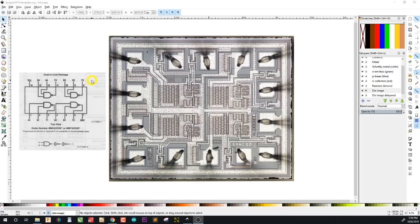Over here I have the pinout for reference. Usually the first thing I look for is pin 1, which usually has a different shape from other pins. We can see that this pin definitely has a different shape — that's probably pin 1. I also look for power pins, which are usually connected to large metal nets. Here's one example, and this pin over here looks like another one.